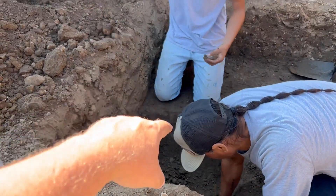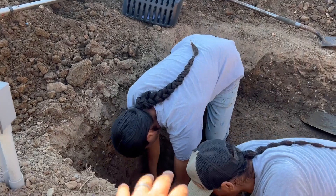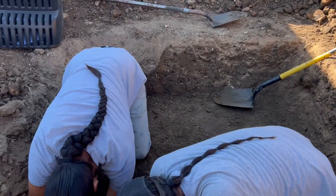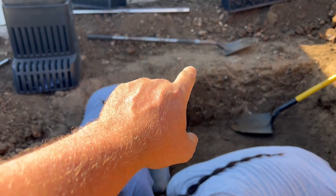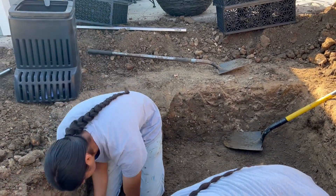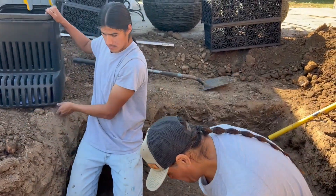Johnny River is just getting the foot dug out for the boot on the pump vault, so that'll be the lowest point in our system. That grid they're sitting on will be the bottom of our aqua blocks. We should have about 7 inches of elevation change from here to the top of our blocks, which should give us about an 8 to 9 inch waterfall coming down into the basin.